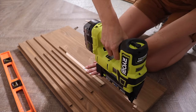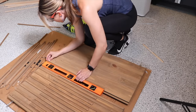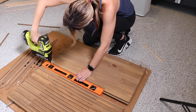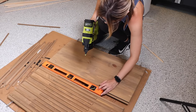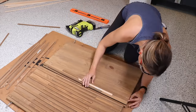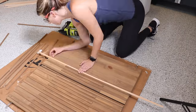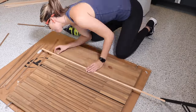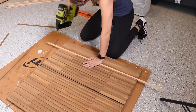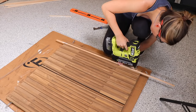I'm not going to fill the nail holes because it looks pretty good without filling and I didn't want to risk the stain looking different than the wood. My original idea was to flute all the way across and even on the sides, but the price of this trim has gone up by over a dollar — it's $2.68 for four feet — so that was going to be about $150 for the whole cabinet. Doing just the front of the doors in this staggered pattern saved a lot of money; it only cost $37 for all the trim I used versus $150.